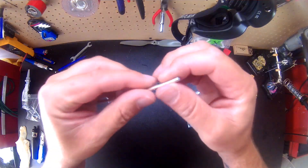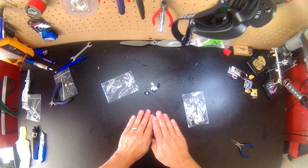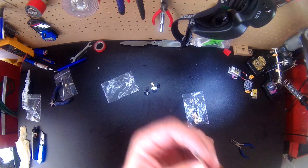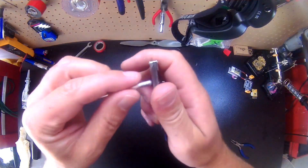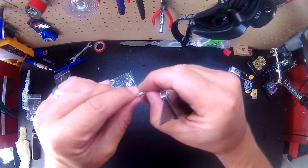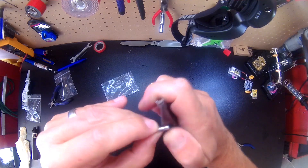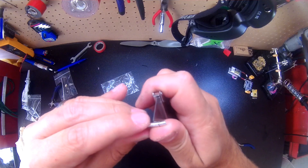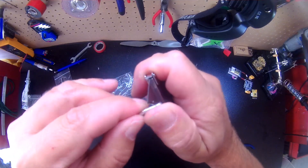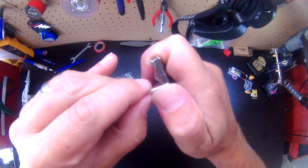First, start with the coax. Cut it down on each end by about three millimeters. You want to try and get it as straight as possible — on a flat surface, just roll it and there you go, nice and flat. Then take a razor knife and carefully — without cutting your thumb off — do that. You'll feel it go through; it's not real difficult, just takes a little patience. About three mils. Be very careful — I have sliced my thumb up pretty good doing this.